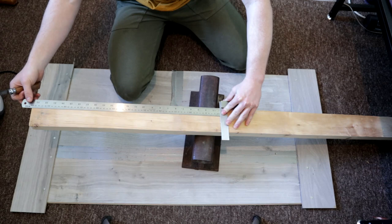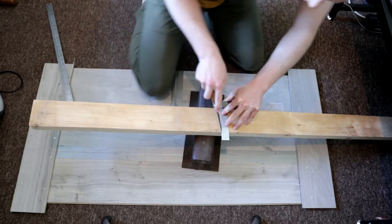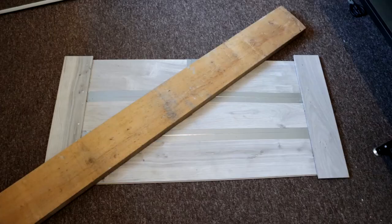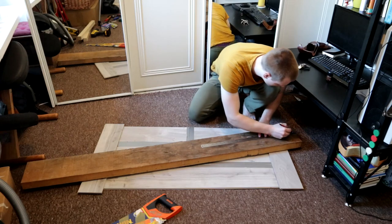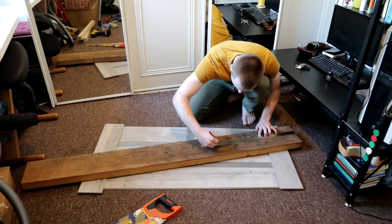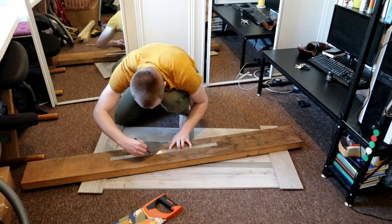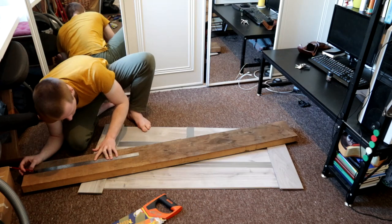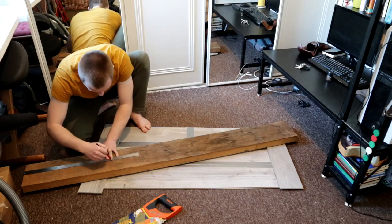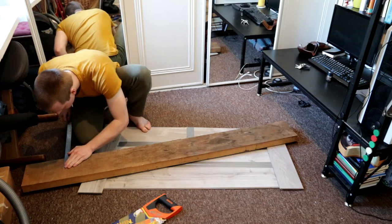The piece of wood I'm using for this project is about 9cm by 4.5cm, and as long as you want it to be. I have a piece that is double what I want, so I'm going to do a rip cut on it. And I hate rip cuts — they are the most awful thing you ever have to do to a piece of wood. A rip cut is when you cut lengthways along the grain, generally along the whole length of a plank, which is slower because of the way a saw cuts.